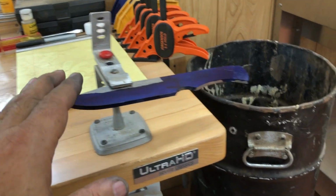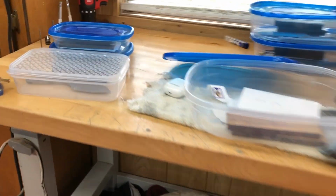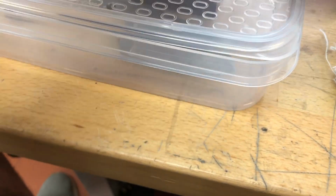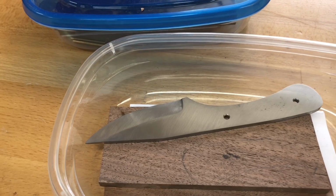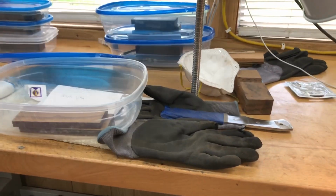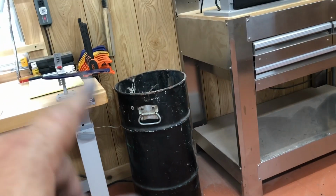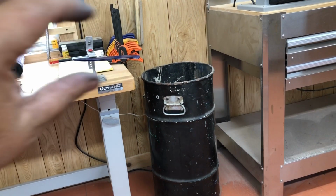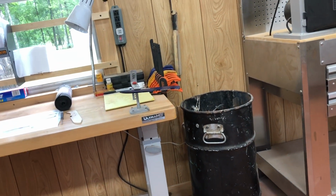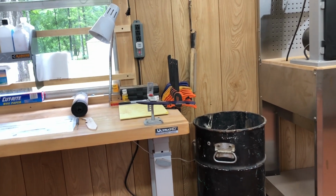So, got that cut out. I've got the Caddo sanded up to 180. And I got Jesse's neck knife sanded up to 180. And Eric's neck knife sanded up to 180. So I made some real progress, and it's only 1 o'clock, and I'm not quitting. As soon as this Dykem dries, I'm going to drill the holes for the handle, and then I'm going to scribe all my lines for the bevels and stuff like that, and then I'm going to grind the bevels on it and try to get it up to 180 as well, because that's a...